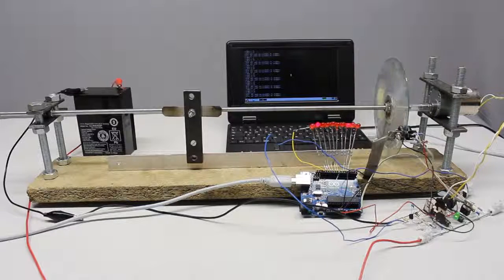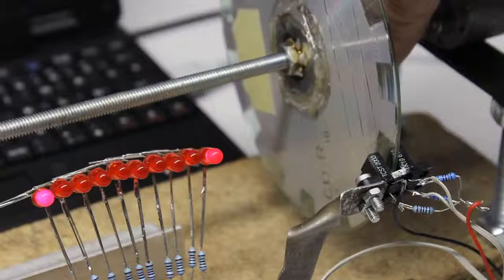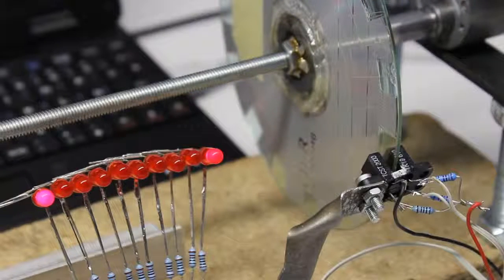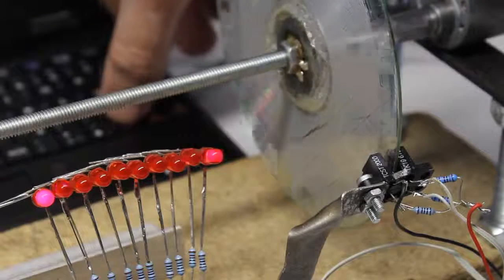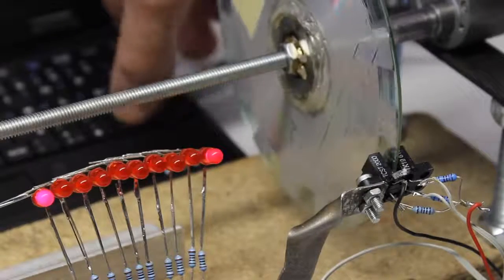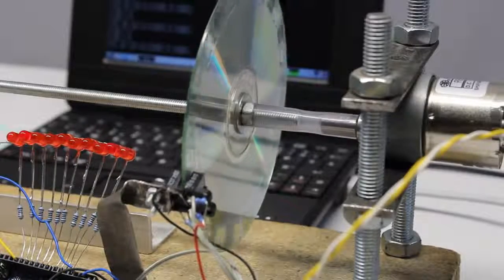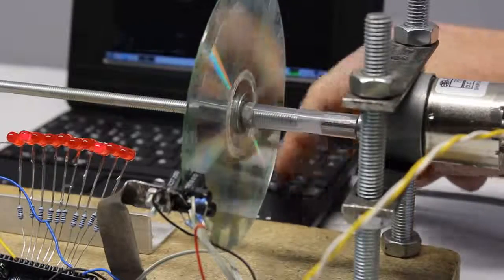Finally, I would like to show you a linear servo with a digital sensor instead of a potentiometer. The rotation of a geared DC motor is monitored by the microcontroller using two light sensors and a toothed disc. The DC motor is turned into a stepper motor, giving a feedback about its actual position through the sensor disc. A threaded bar is attached to the output shaft of the gearbox, by which the rotational movement is turned into linear movement.